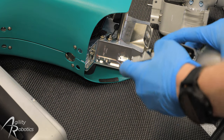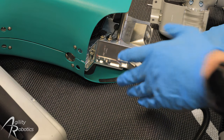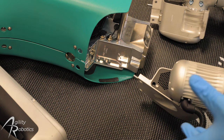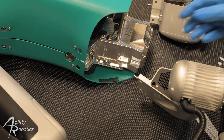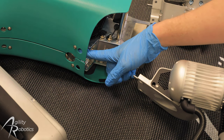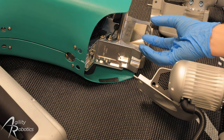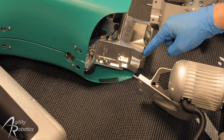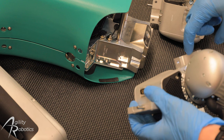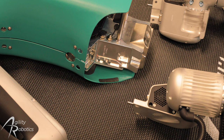Because the limbs have hot swap connectors on them, we need to use dowel pins to guide the legs in during installation. So the first thing we're going to do is, as we mate the leg to the torso, the dowel pin on the leg will go into a hole on the torso. After that engages, we'll slide the leg a little bit forward. Then a dowel pin on the torso will engage with a hole on the leg. And after all that is done, we'll push the leg forward, seating the connector.